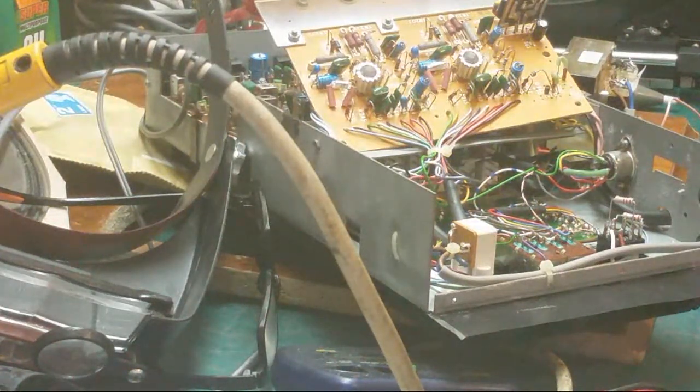Yeah, because you never know, do you? I mean, there's a diode. No, that transistor bothered me because there's a diode right next to it that's gone pop. John switched it on, and he got smoke after a couple of minutes, coming out of the volume control. And that lot's right under there, and the fuse was good. It's not a dead short because it would have blown the fuse straight away, but the fuse was beginning to glow like an electric element.